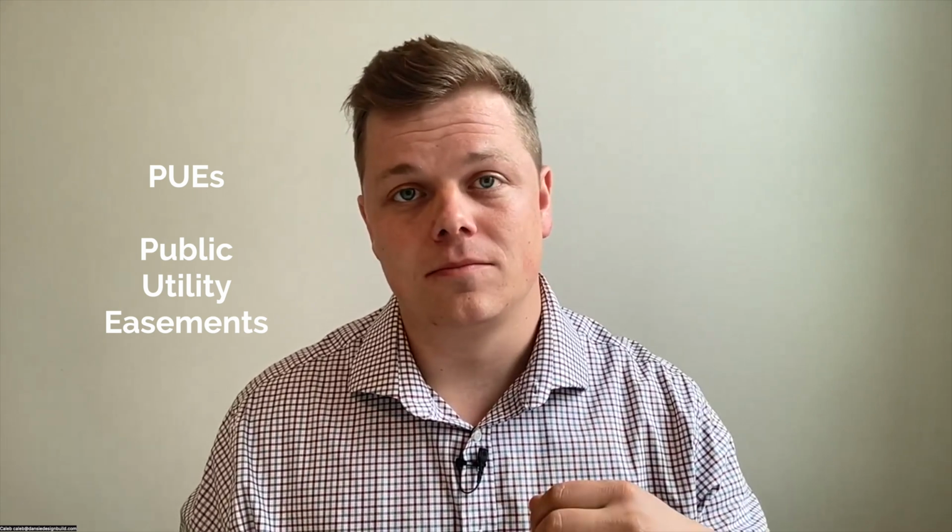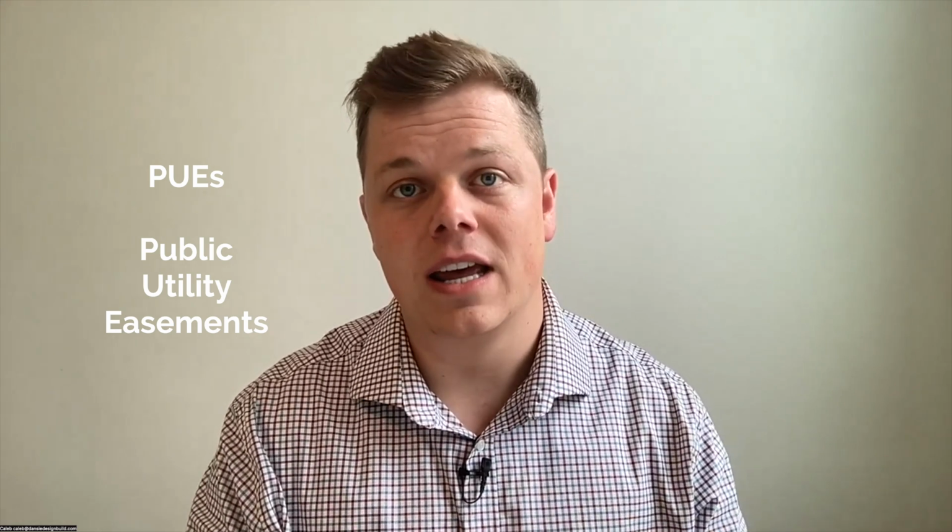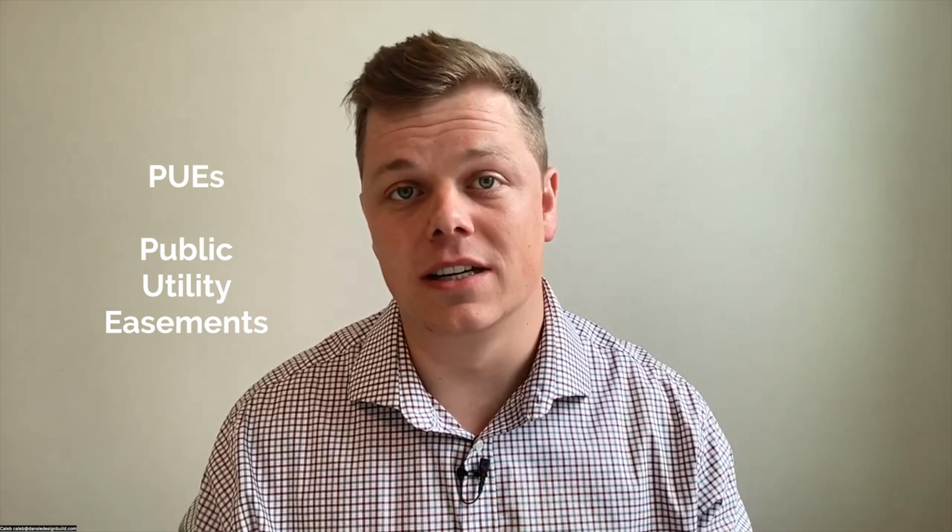So once we have those figured out, the next thing that we're going to be looking at verifying is the PUEs, which are the public utility easements. And those are essentially agreements or rights to that portion of your property that's been given to the utility companies that provide services to the neighborhood, so that they can run those lines and maintain the utilities for your home and for your neighbors.